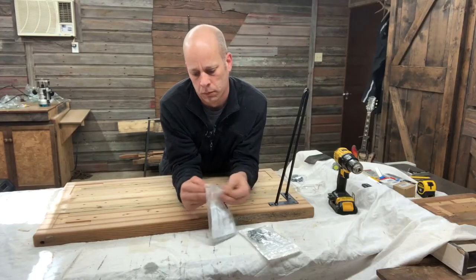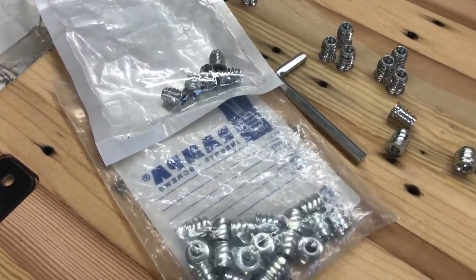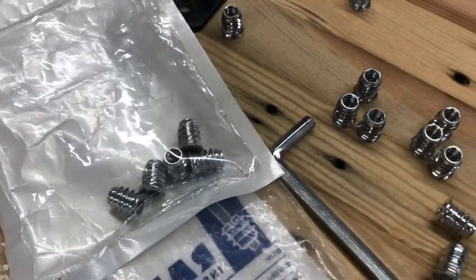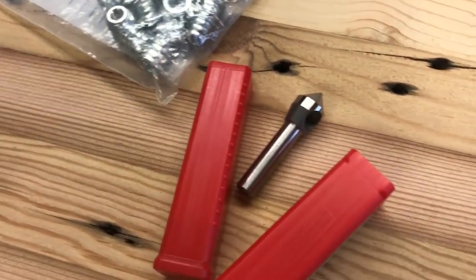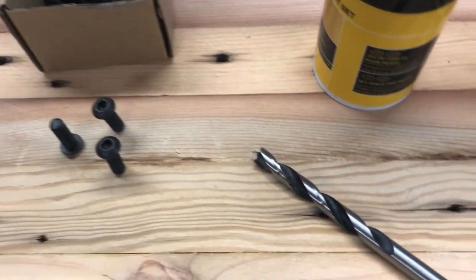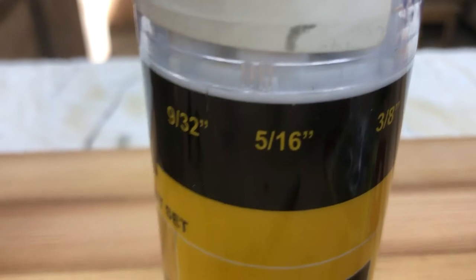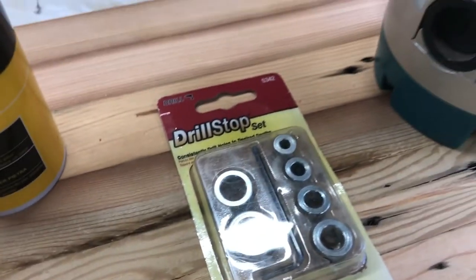Hardware — we're going to spend a little bit of time on this because it is important. There's not a whole lot that you need even though it looks like a lot. I got two choices here: I got Rampa — we use those for different builds — and this is your Amazon bestseller. Generally for tables we use the Amazon bestsellers; they're a little bit cheaper and they do a great job. A countersink bit will clean up any chip-out from drilling these threaded inserts. Those furniture bolts are button head and work really well. The 5/16 size is for the Amazon bestsellers — a lot of people don't even tell you that.